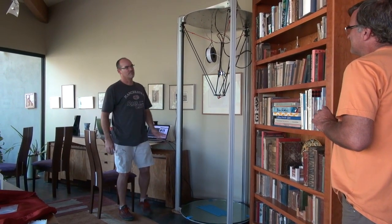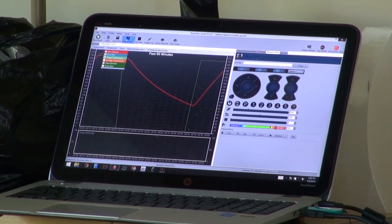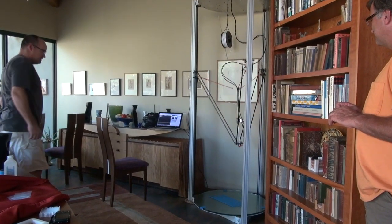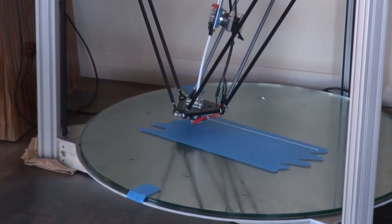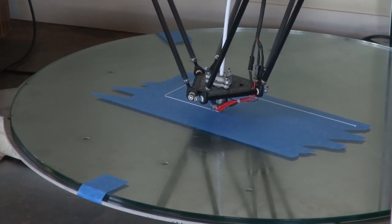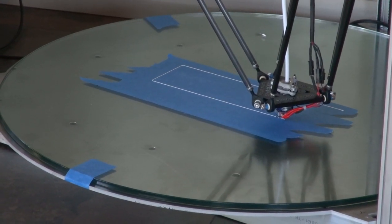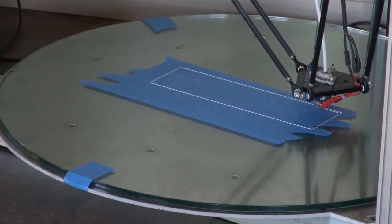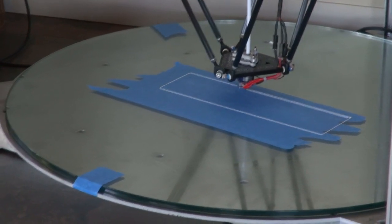It's going to take about four minutes to heat up. It's just coming up on 200 degrees right now. When it hits 230, it'll kick it into gear. This is just laying down a perimeter layer — it puts this first layer outside our actual print area just to give the extruder something to do, run some plastic through it and make sure all the temperatures are correct.